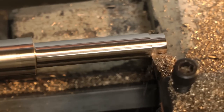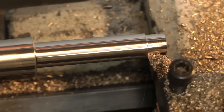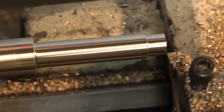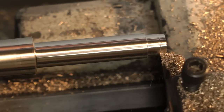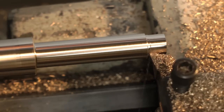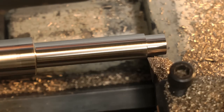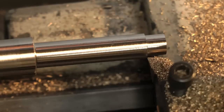For the purposes of this instructional video I will leave the piece of brass sticking out from the chuck a long way and just take light cuts. I initially turned down the piece of brass to half an inch in diameter. I now need to machine the end of it down to 3/8ths in diameter to fit in a hole in a gas burner that I'm making — this is a gas jet venturi pipe. After a while you will get quite close to the finished size by eye and experience, but either way use the micrometer regularly to check that you haven't gone under size.